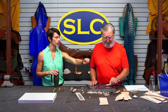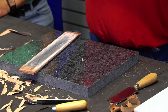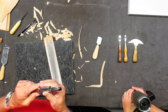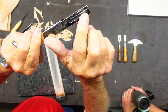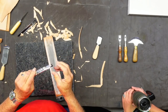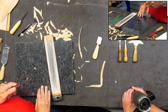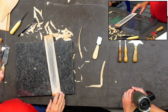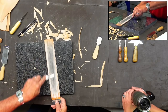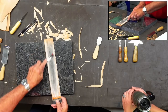Mike asks: can the first three knives be stropped though? Yes. This knife just has a little razor blade in here. Before I ever put it in, I would use a pair of pliers or vise grips and go to a buffing wheel and polish it. But you can strop it on a strop - just pull away from the edge when you're stropping a blade.